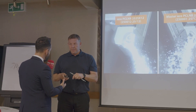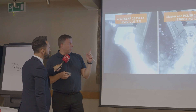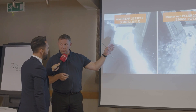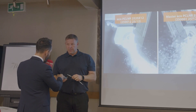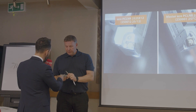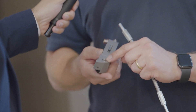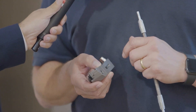And is this a new innovation from the Hoffman Group UK? Yes, it is. We've had through-tool cooling for quite a while on turning tools, but this is a development. You can see from the video we've gone from two channels to four. We've also reduced the height of the tool a little to give it better access for swarf and getting the cooling tip to the tool. And input points on the tool — there are actually two: one through the back and one through the front underneath. So hopefully it simplifies installation for the customer.